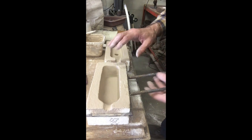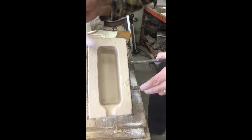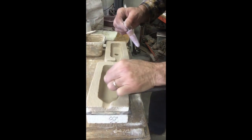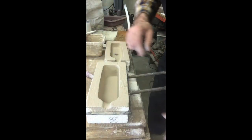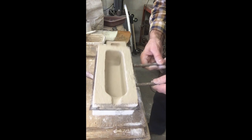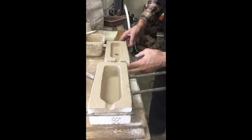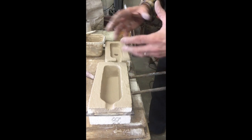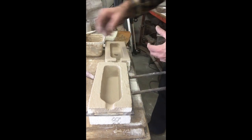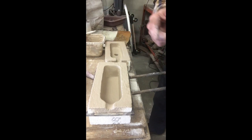One of the reasons I use this tapered bit is that when we clean out the crucible, we want to be able to pull out the flux and bits of debris that form on the side of the brick. This gives us the ability to clean the brick and use it many more times. If you didn't do this, the flux would really attack the firebrick and destroy the surface — and I'll show you a picture of that as well.